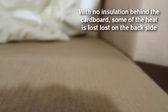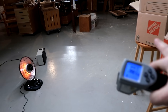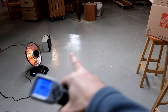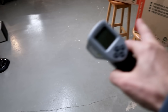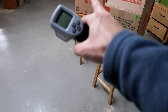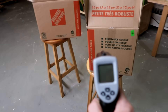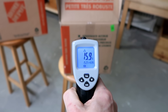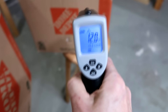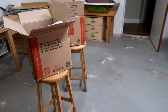That lower reading is because there's no insulation right there — I just want to see how the surface feels. The box I was measuring is totally on-axis with the heater, whereas this other box here is 60 centimeters or 2 feet off-axis at a 1.8-meter or 6-foot distance from the heater. On this side it reads 15.9, and on this other side it reads 18.8 degrees.